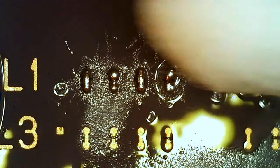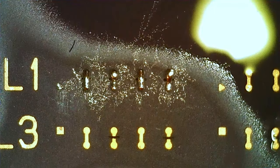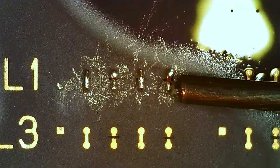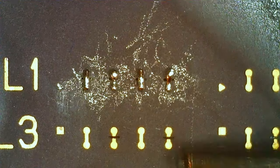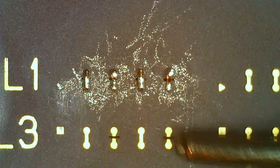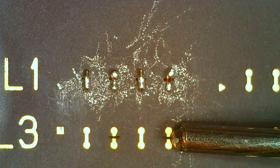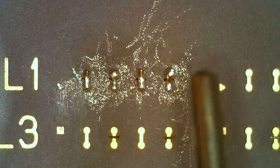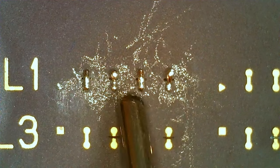Now this is sensitive, so you can't peel it off with your fingernail. Like I said, the size of these dots is very small, so let's take this solder here. This is 0.8 millimeters. I would ideally want to have 0.5, but about that, so you can see the dots, from the edge of the dot here down to the edge here, is less than 0.8 millimeters. On the Athlon XP, I think it's slightly wider on the vertical, but it's about the same on the side here.